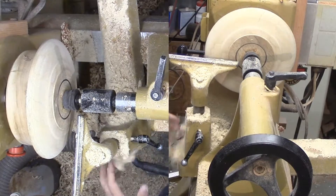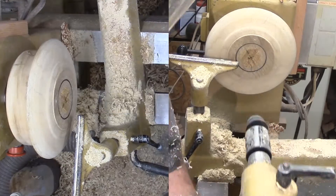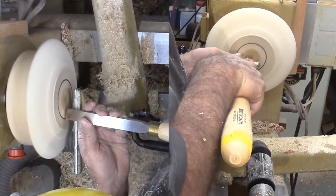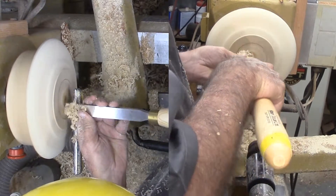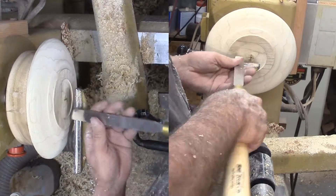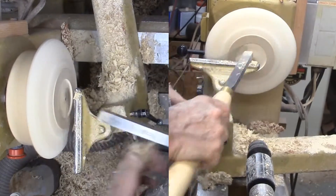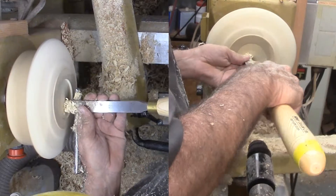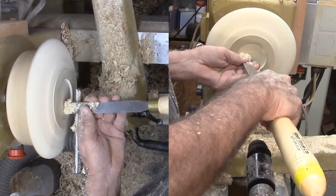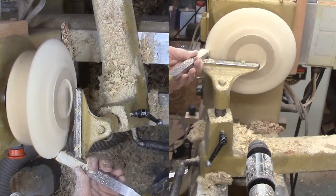With much of that done, I can cut the mortise. I'm trying for only about one eighth inch or less in depth. Recently at club meetings, I've seen items with three eighths inch or deeper mortises in the bottom — that's way too much and leaves way too much wood in height. I think they're afraid of blowing out the mortise with expansion pressure. But how about making a very small foot with more wood as it passes the bottom of the mortise? This wood will support the pressure and make the bowl much more appealing. My bottom line is that a quarter inch mortise in an item is way too much — it's too obvious how it was mounted and way too heavy.